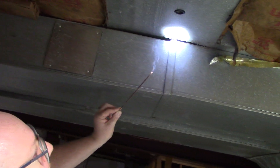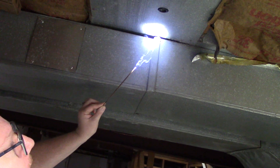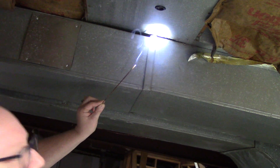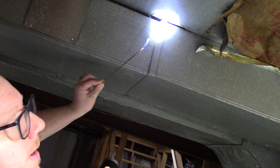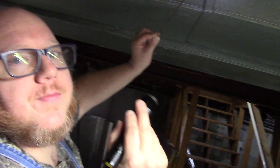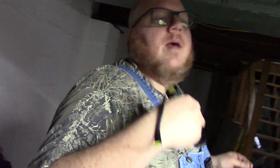So like I said, we're sucking most of the air through the house from the basement, and without any tape over that filter to seal it off, we're sucking the basement air. If your house is very dusty — you notice a lot of dust, you dust once a week and you can't seem to keep your house dust-free — this is why.